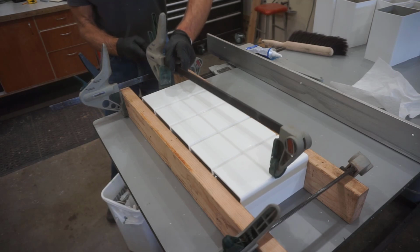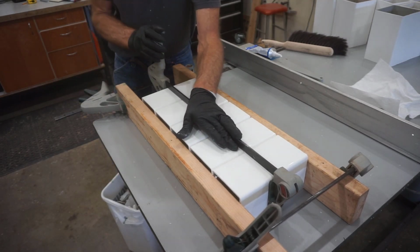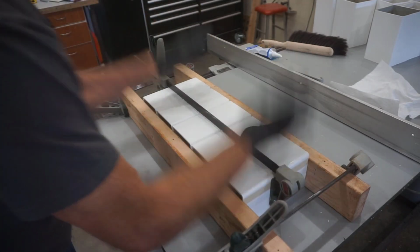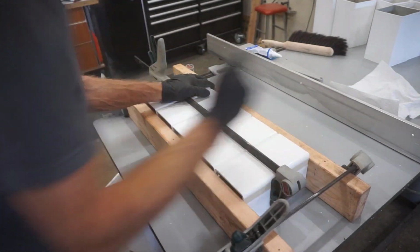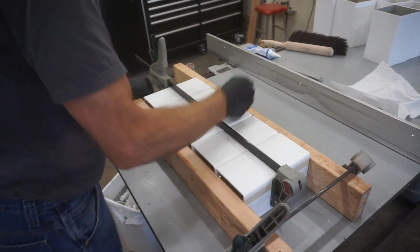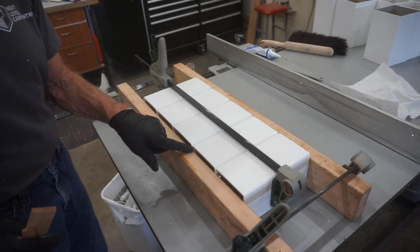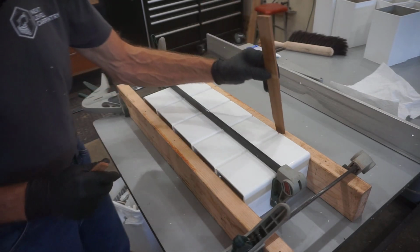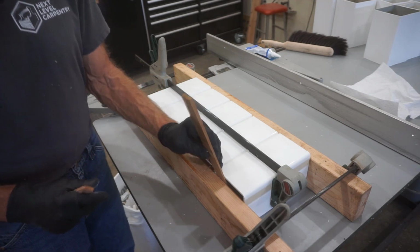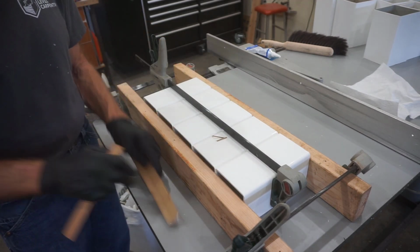And finally, take that long clamp and put a little pressure to keep the compartments snug together as the glue cures. Tapping everything firmly down to the bench top like this assures alignment of the faces, and good clamp pressure on the blocks assures alignment of the ends. If by any chance you got discrepancy in the length of the tubes, use shims to make sure that at least one end of all the compartments is lined up. Because I use the length stop, none of this shimming is necessary.